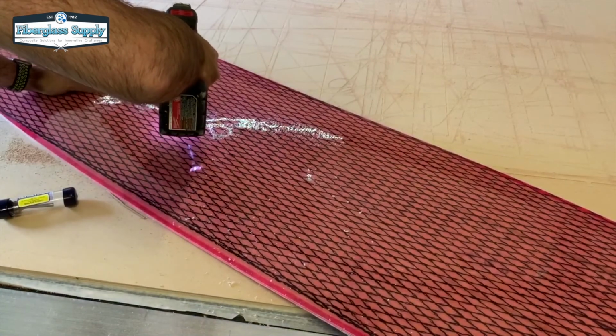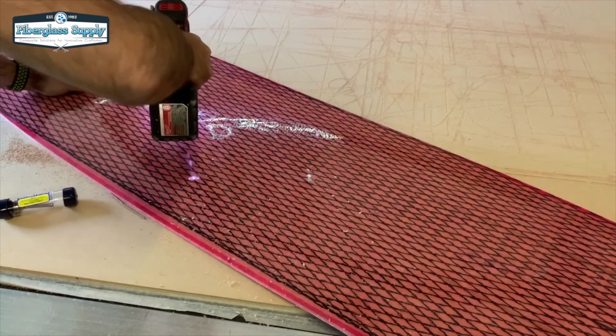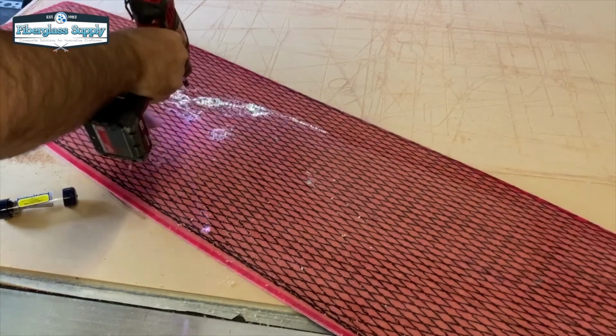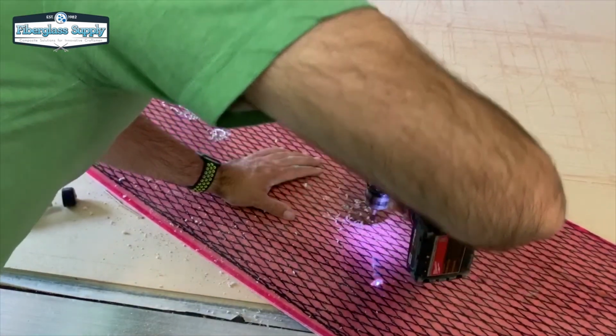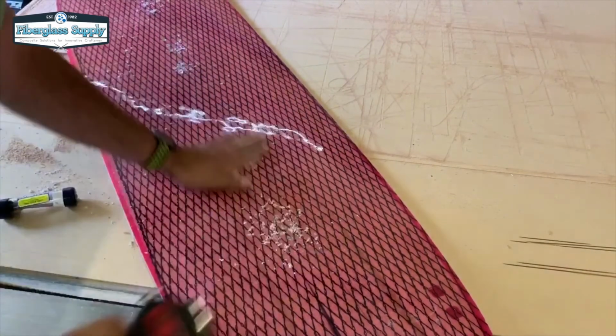We're going to jump back over here and open up our binding inserts. I'm using a countersink bit to just drill down and open those up. And then we pack those with clay so the resin wouldn't get into them, and then we'll just either run a tap through it or clean it out with a toothpick.